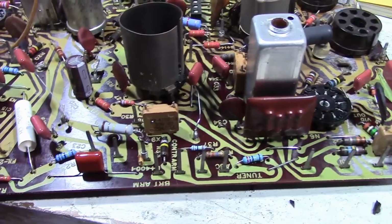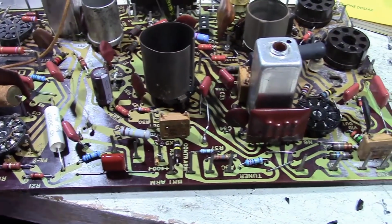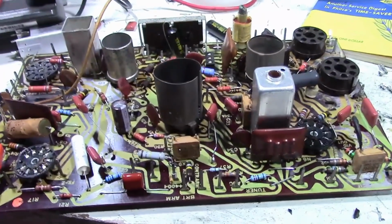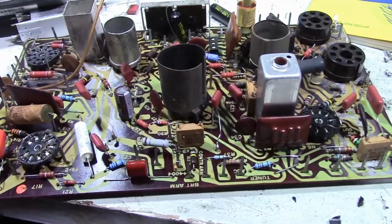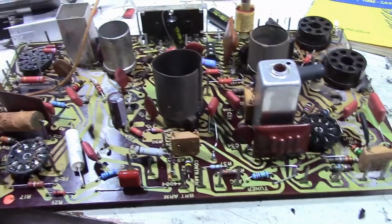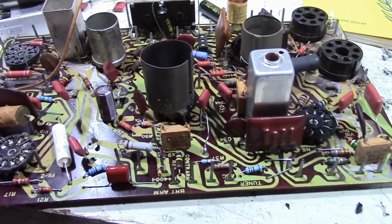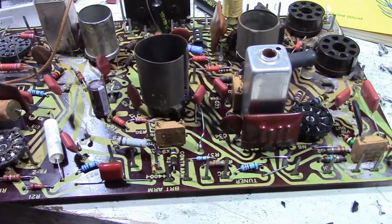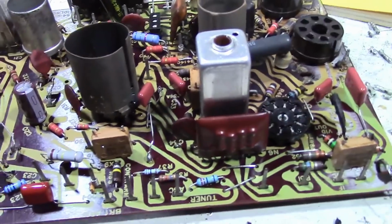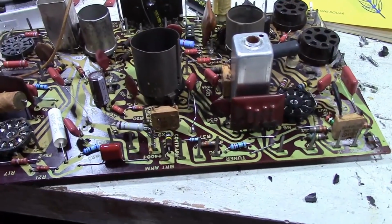They also, I believe, have less noise. So it's kind of an odd topic, but essentially like the electrons flowing through a device kind of bump into each other in the atoms, and I'm probably oversimplifying things, but they can make a certain amount of noise. Again, in this application, I don't think so. If it was a super high impedance, very sensitive, high gain piece of instrumentation, yeah, it can make a difference. In an old TV, probably not. But that's why they predominantly make these days, is what I was getting at.